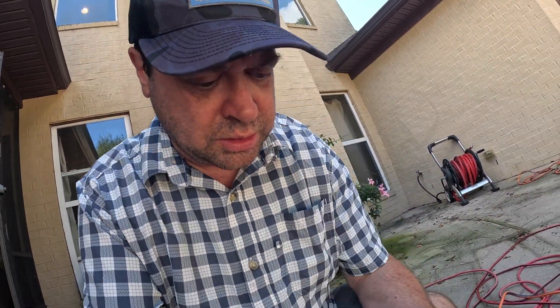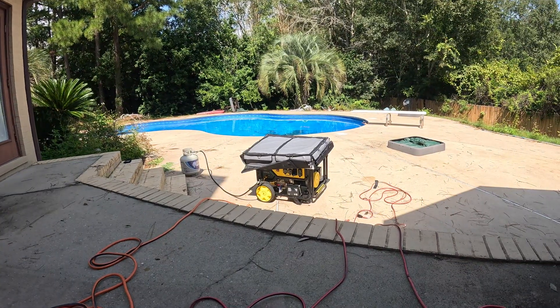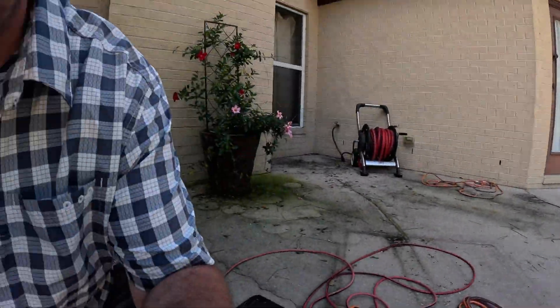After Helene I was out of power. On Friday I hooked up the air conditioning using a 14-gauge extension cord — had it set at 74-75 and it was tripping the plug. It's because you have to use 12-gauge. This cord is about 100 feet, and evidently the longer the extension cord, the more it diminishes the electricity flow.